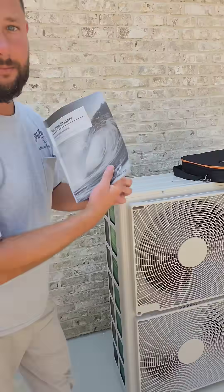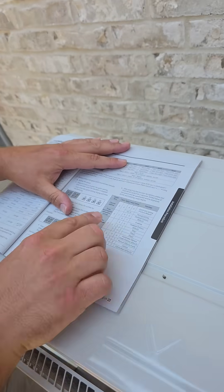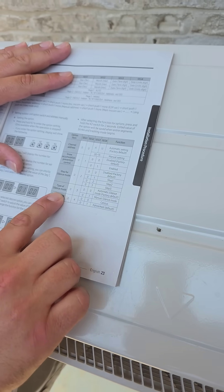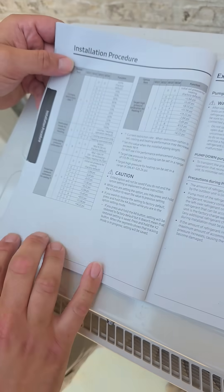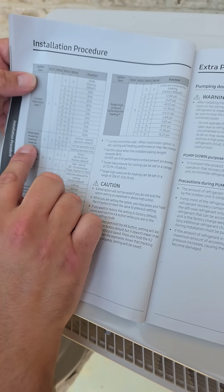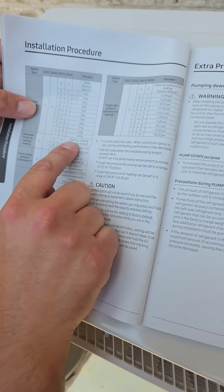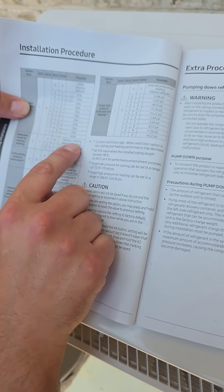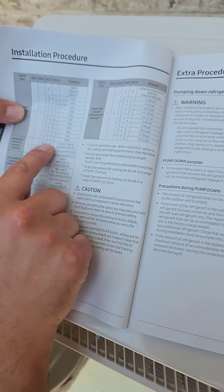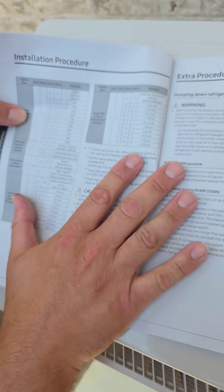We've got a manual. Manual is your best friend. Read the manual and on page 23 you're going to see we have these options — snow accumulation prevention mode, silence mode. But over here on page 24 where it says dedicated mode for cooling or heating, we can see segment 2 step 7. Over here we can make this — the default is cooling and heating operation. We can change that 0 to a 1 and make it cooling only, or change it to 2 and it'll do heating only.